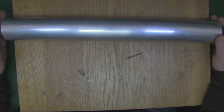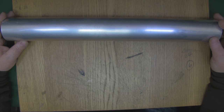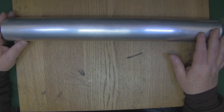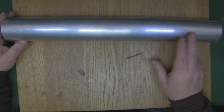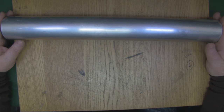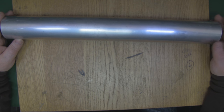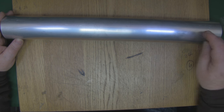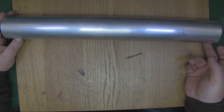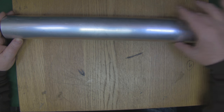In this video I'm going to construct a 2.4 gigahertz slot waveguide antenna. This one's going to be slightly longer and more powerful than the first one I built — just three slots on the waveguide — but this one's going to be six slots long and omnidirectional, with slots on the opposite side, albeit with quite big nulls running down the sides.